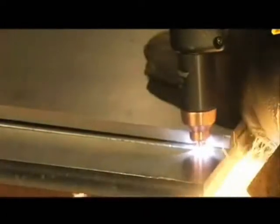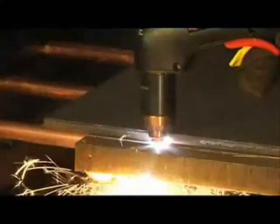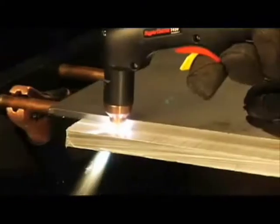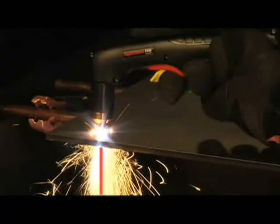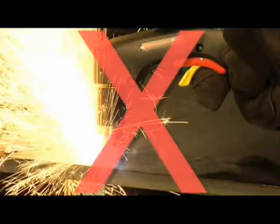When nearing the end of the cut, angle the torch into the direction of the cut, allowing the arc to come out first, to ensure a complete cut. Maintaining proper travel speed is key to successful cutting. Watch the arc beneath the plate, as sparks should lag 15 to 30 degrees behind the cut. If the sparks are vertical, the speed is too slow. If the sparks are perpendicular to the cut, or are spraying up from the workpiece, then the speed is too fast, or the system does not have sufficient power. Lag lines on the finished cut edge should also be about 15 to 30 degrees.